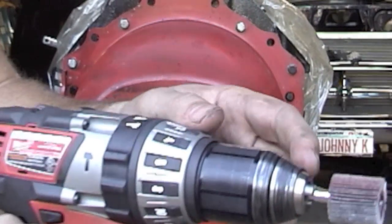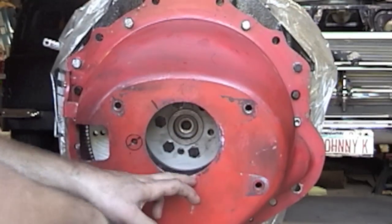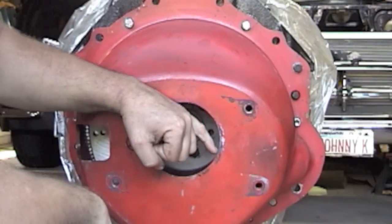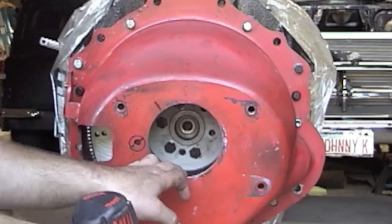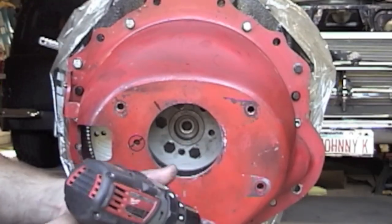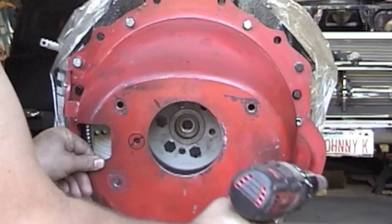Use an electric drill with a little flapper disc. What you want to do is go ahead and hit the surface. Don't go nuts — you just want to make sure you knock off any heavy burrs, because that'll throw your dial indicator off. If that plunger comes around and hits a big burr, you'll get a false reading. You're not trying to take off massive amounts of metal. You're just hitting it with some emery cloth paper. You can do it by hand too. Just go around a couple times, it cleans it up, and you're done.